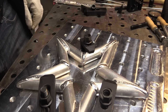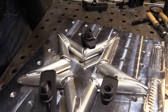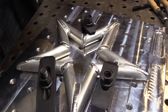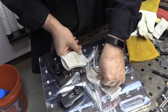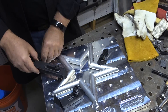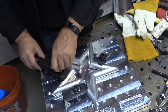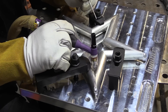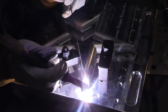I've got quite a long arc going right there — you can see I got a little oxide in the puddle, probably mostly from the long arc. Okay, that's one side done. I didn't snug down on these clamps too tight — a little tighter than finger tight — but the whole thing's warming up quite a bit. I've got my TIG Finger XL out for holding hot parts without screwing up my gloves. At this point I'll just put it in there finger tight because I don't want to lock it down and mash it against the welds and make it crooked — it's not going to move a whole lot from here on out.